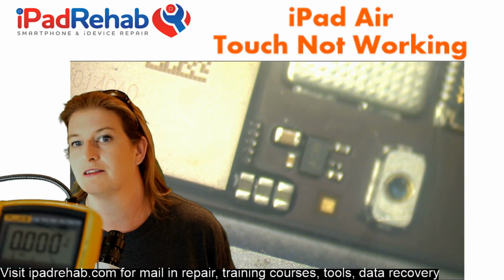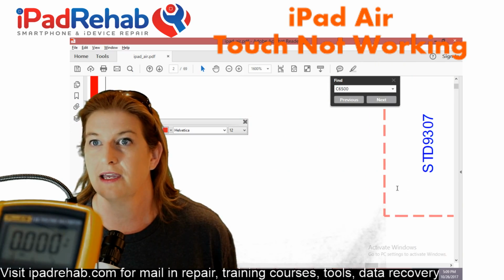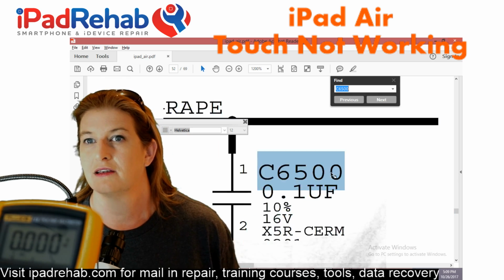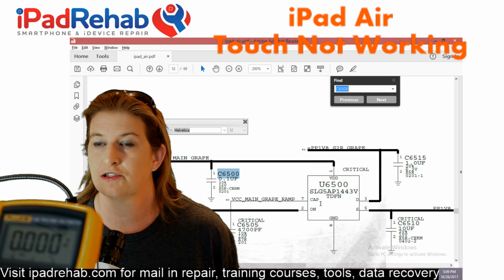Let's go back and keep following our puzzle. So we'll get rid of that. Okay, so now we found 6500. So what does that mean? Let's get back to our spot. Okay, so now we've checked the box on VCC main. So that's present. The PP1V8 grape is present.